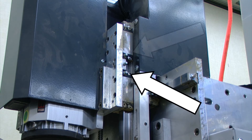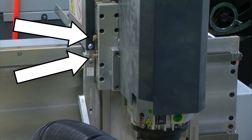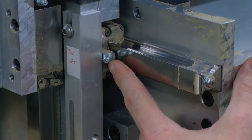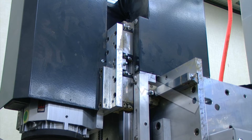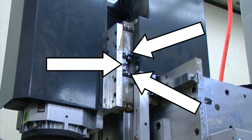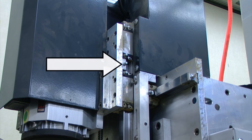If we look along the Z axis, we have more fittings that need to be greased, and this goes for the other side of the router as well. In total, we have four grease fittings for the Y axis linear guides, four grease fittings for the X axis columns, and five grease fittings for the Z axis. Four of those are for the linear guides of the Z axis.